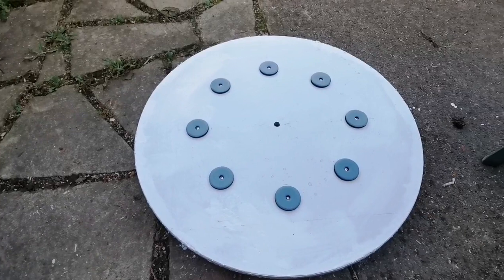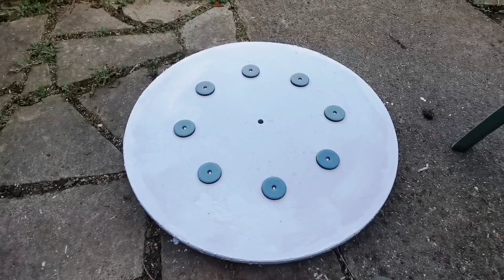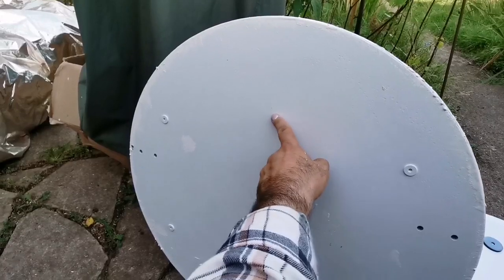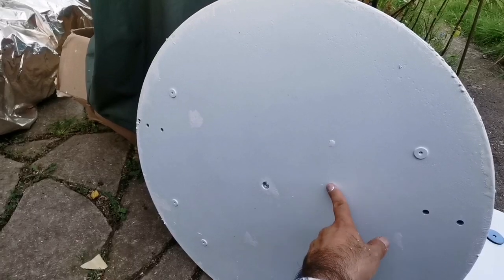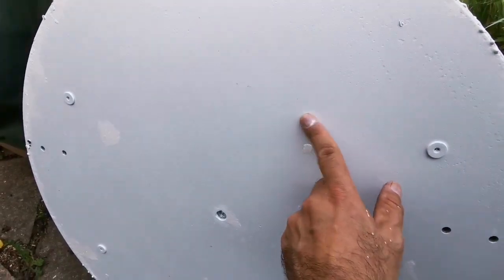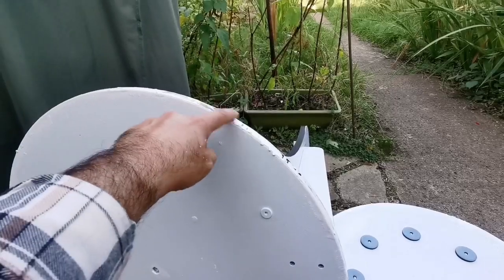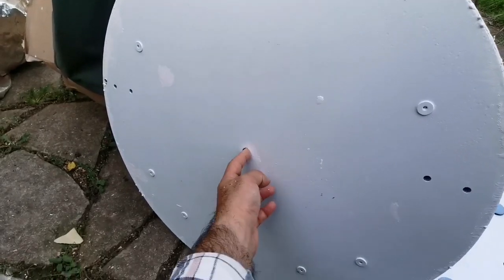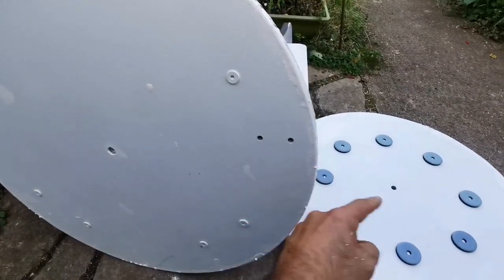Nice, moment of truth. I'm going to see if I can actually fit this. Is the bolt long enough to fit on this? So let's see. Some say to use formica, a kind of rough plastic. But some others say that they have successfully used Hammerite paint, which gives a natural wrinkle and roughness to the paint. So I use that. I may just repaint this. This is just ornamental. I just wanted to make sure this is weatherproof. And now I'm going to put it. This will be coming on top of the Teflon, so this will be sliding on the Teflon.